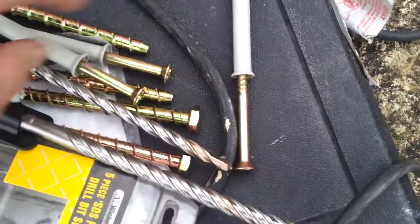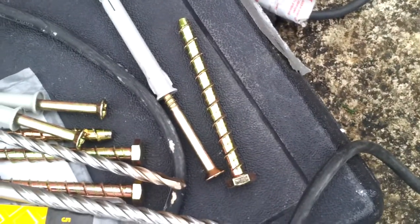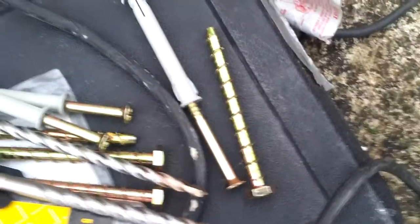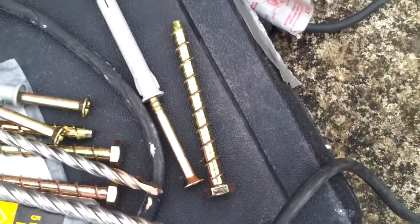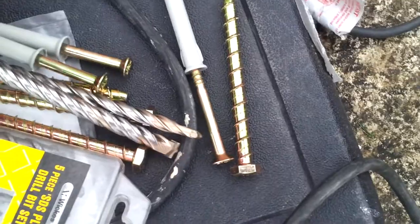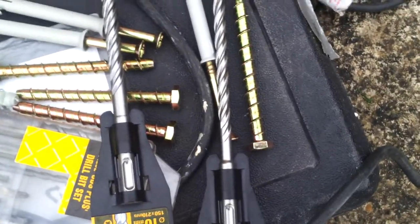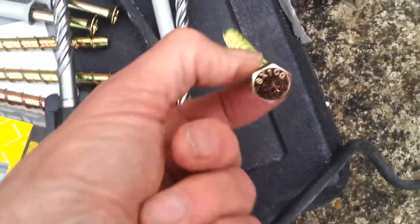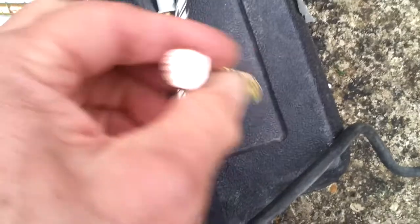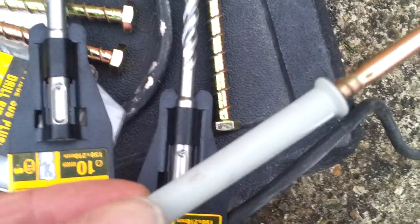The plug goes through from the front. Or do I use these winding fittings? They seem to be gaining in popularity with frame fixing people doing doors and windows. You need an SDS drill generally. I think what I will do, because the winding one only needs an 8mm hole, is use the winding fitting, which needs to be wound in with a socket set. It's marked on the head what size drill you need — this says 8x100.